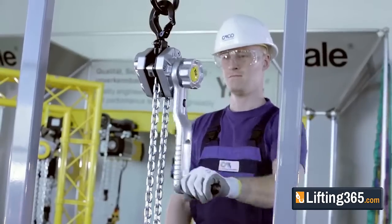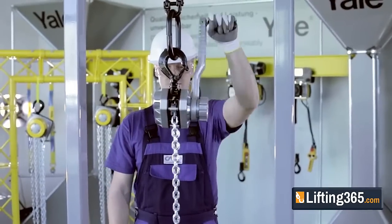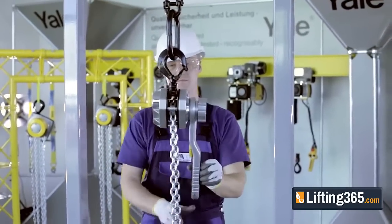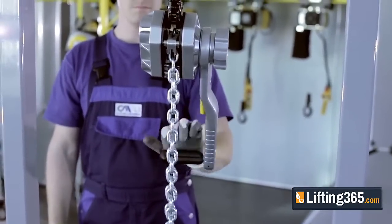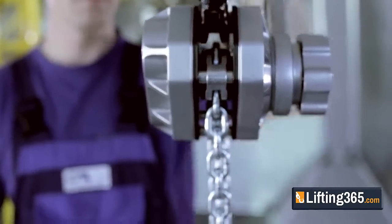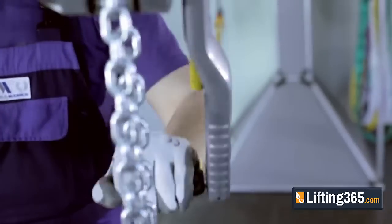When using the crank handle, the required pull force can be decreased by up to 30 percent, helping reduce operator fatigue. If the operator folds the crank handle to the chain side, their hand and body will align with the load chain. This helps reduce the twist effect and minimizes the need for the operator to stabilize the hoist with the other hand.